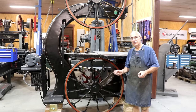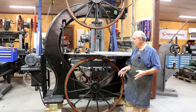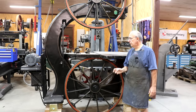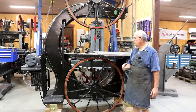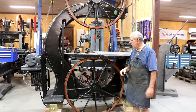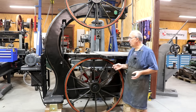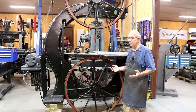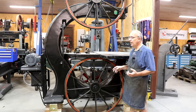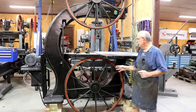I'm pretty happy with how things have turned out using the variable frequency drive on the bandsaw — that was not my original plan; I was just going to put a motor starter on it. But in retrospect, I really think it was the right thing to do. I really like having the motor control functions: the soft start so we're not slipping and trying to start this big heavy wheel from zero at full speed, and also the braking deceleration so it's not taking a really long time to spin down — which is a nice safety feature. When you hit that stop button, you don't want the blade turning for another 30 to 45 seconds. Right now it's on 10 seconds and I'm going to try to bump it down a little bit faster.